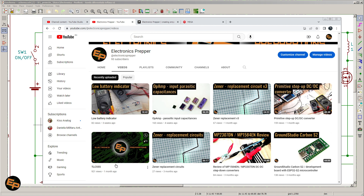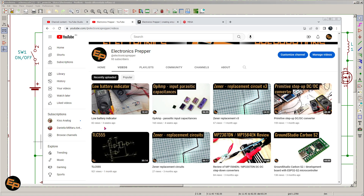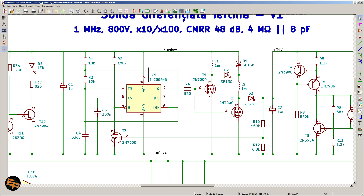About a month ago on my channel, I posted a video about the TLC 555 timer, and then there are four more videos regarding various different topics — I'm not going to repeat myself. When I built this power supply, I combined all of them. We have here a small circuit with four resistors, two transistors, and an LED — this is a low battery indicator. Then comes this rudimentary power supply that has a TLC 555 integrated circuit as a control circuit, and two separate inductors that are charged in parallel and discharged in series.